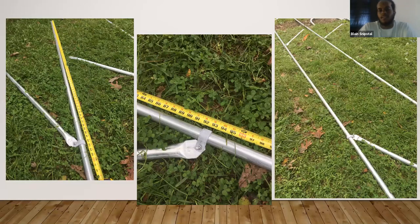For the snow load braces, again, for this notes tunnel, to figure out the placement of your brace bands and your struts, which are those upright smaller members, the math is you take the overall length of your snow load brace, which was some number that I can't remember, and you divide it by 3, and that gives you 93 inches. So why do you divide it by 3? Well, if you see by this picture over here, there's 3 spaces that you're creating. And in construction, you are often dividing by the number of spaces, not by the number of pieces, to figure out placement of things.